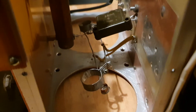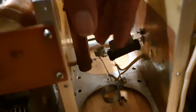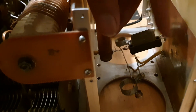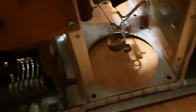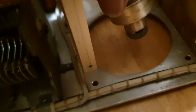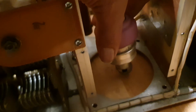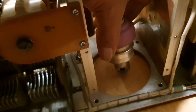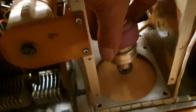The copper connector is going to be pushed on — a very tight, snug connection — and copper is a much better conductor. Then the aluminium tray is going to slip inside the chassis area. Imagine an aluminium tray across the chassis of the valve housing unit — that's where the valves are going to sit, dropping through the new mounts. It'll dissipate a lot of the heat and also shield any unwanted RF radiation from the anode and cathode linking bars.